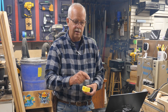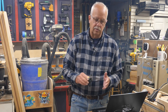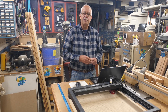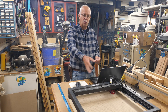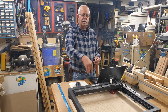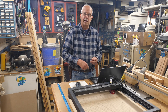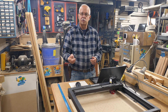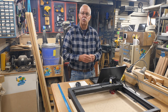If you're using a 10-watt laser you'd be burning some grooves in there, so you'll need to make some adjustments. For a 5-watt laser this works just fine. I've done this on half-inch MDF mostly because it's cheap, and if the grid gets messed up it's very easy to just take the mounts off, slap another piece of MDF on, and burn the grid again. You could also use plywood or something of that sort.